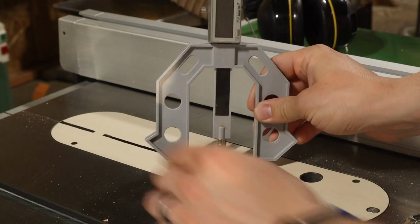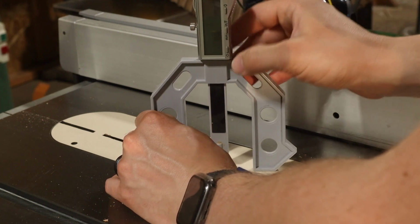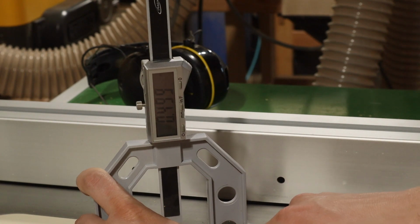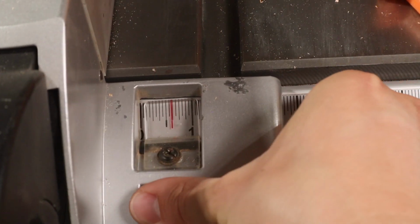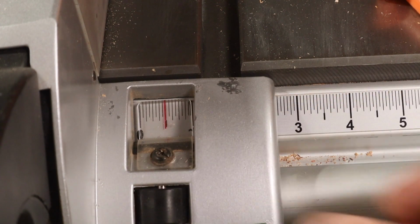Once you have that measurement, you're gonna wanna set your table saw height to exactly that measurement. I like using one of these gauges for setting my height. It's really accurate, really easy. I've got a link to one of those in the description. With that height set, you're going to move your fence into the exact same position. And so for me, it's going to be 1/2 inch. And this is going to be the starting place for all the different cuts.